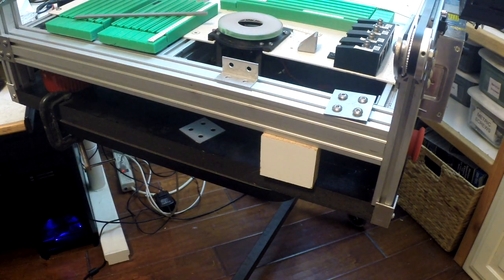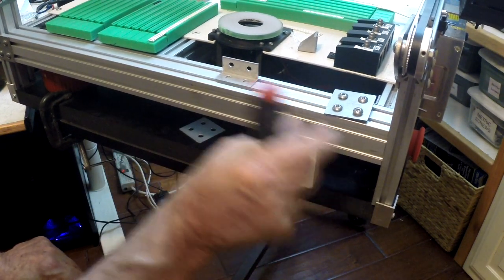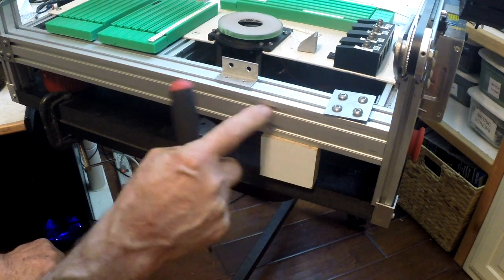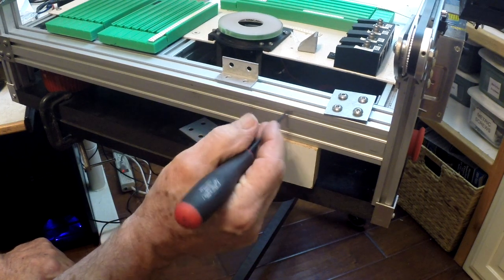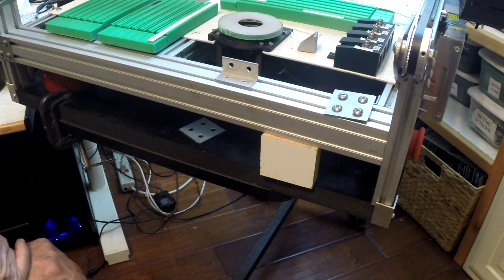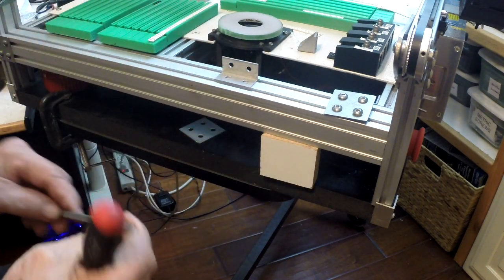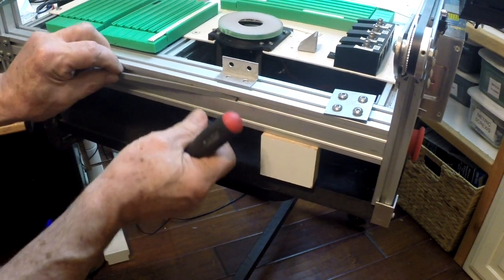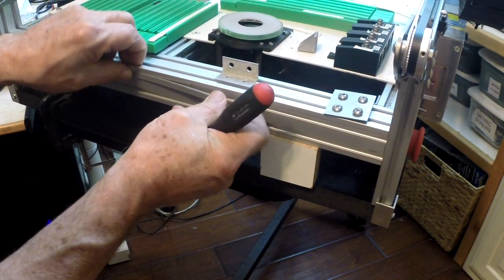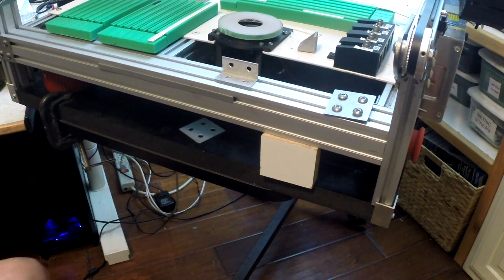Also, any of my sensors that mount on this rail, I can move them back to adjust them. I printed a little plastic typical T-nut that fits behind here, and that's tapped for probably a 3mm screw, and it makes it easy to mount all your sensors. Stuffing the wires in here makes a nice clean install. And I printed up these little gray strips that are about 6mm wide, and you can press them in there and they cover the wires up. So anyway, hope that's worth something.